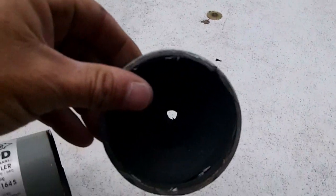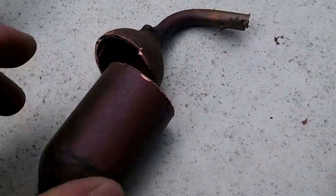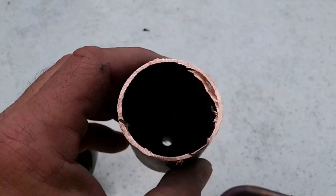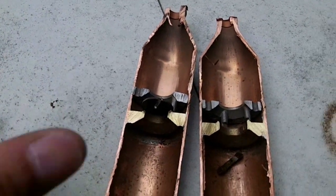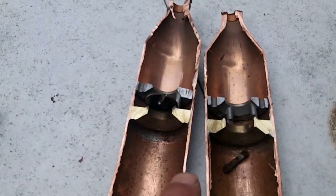Here's what I found in the Trane XC1000 muffler — just an empty cylinder, nothing whatsoever. That piqued my interest: why did the first one have a check valve and this one didn't? I figured surely the heat pump would have a check valve. But here's the Payne heat pump muffler — no check valve either. I thought it was weird that the Weather King, a really cheap builders-grade unit, had a check valve, and these didn't.